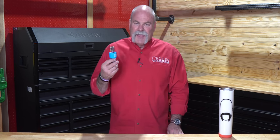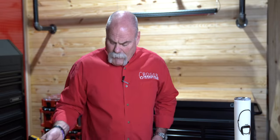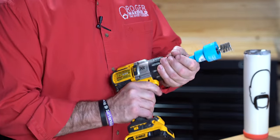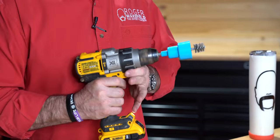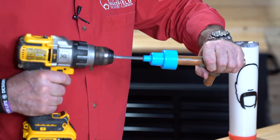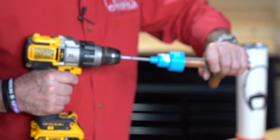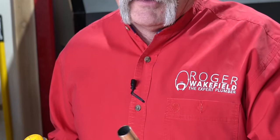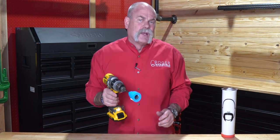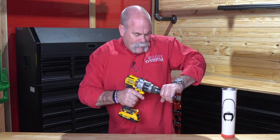I know we've all got fitting brushes and we use them — they help us do our job faster. But what I like about this one is it's automatic. So now you can clean your fittings just like that. No better way to clean fittings faster. When you've got pipe out like this and you want to clean copper — this is a leaking shark bite that we removed — quick and easy, that is beautiful. If you're running a lot of water or in a position where maybe you can't get paper in behind it but you can get in with this on top of it, this tool is fantastic.